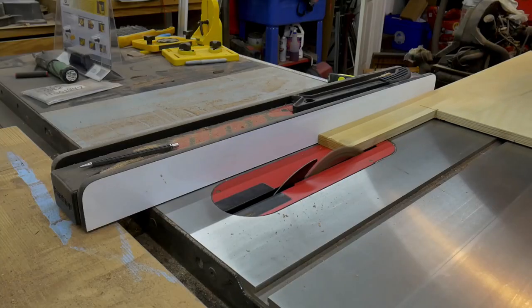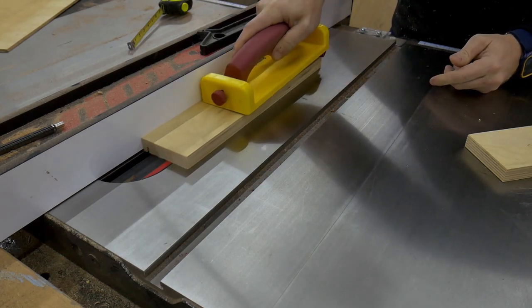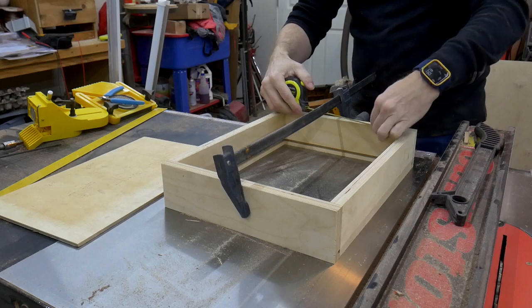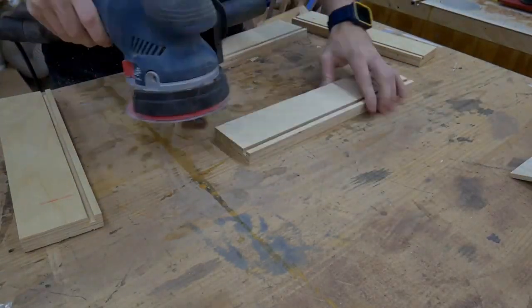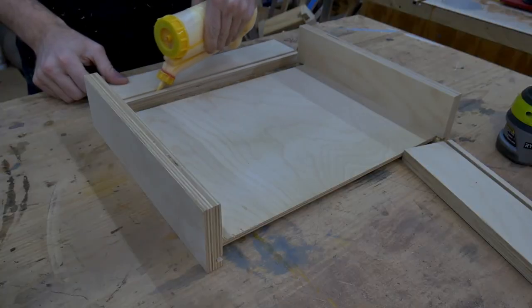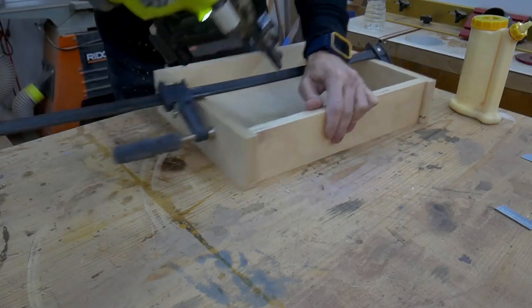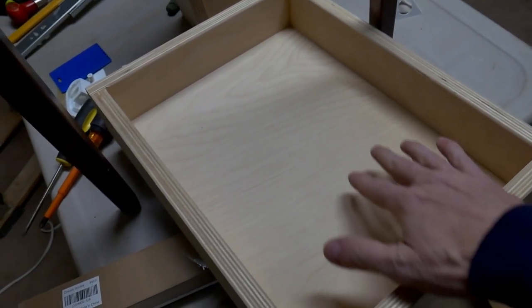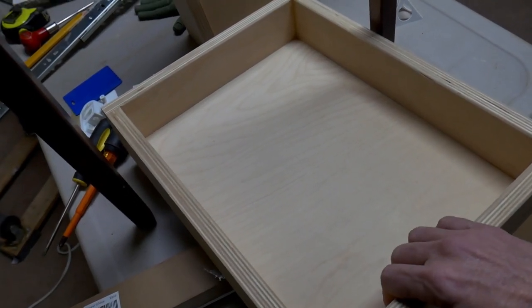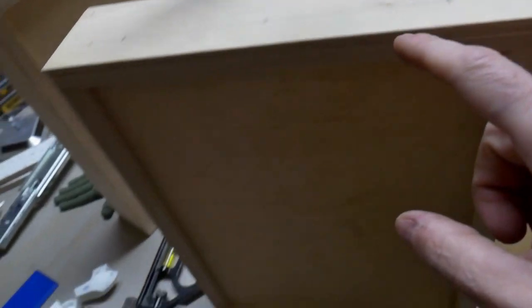The pieces are sanded off camera, cleaned with turpentine, and set aside for finishing. Now onto the drawers — I cut the sides of the drawers out of some three-quarter inch Baltic birch plywood. I add a dado to the lower edge of each strip to accept a quarter inch Baltic birch drawer bottom. I do a quick dry assembly so I can measure exactly how big that drawer bottom should be. I decide it would be easier to sand the individual pieces before assembly. The drawers are assembled using simple butt joints with glue and nails. I also rounded over the top edges where hands may come into contact with the drawer, sanded the outside, and then started laying out where my drawer slides are going to go on the inside of the body.